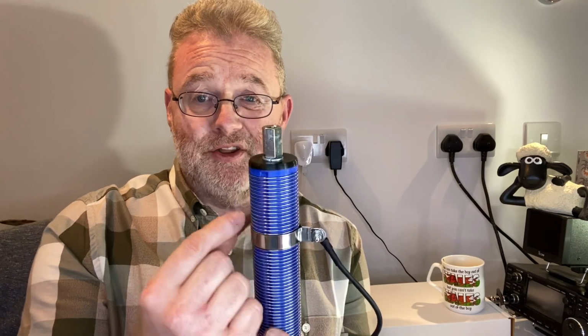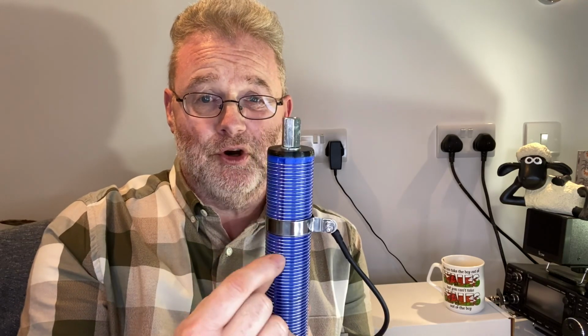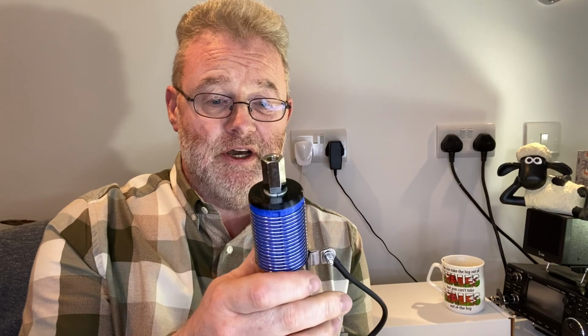The option would be that you would take a little analyzer with you, put it on the end of the coax and just move it up and down. Maybe listen for the background noise getting higher when you get to a better tune. And if you so wish, people mark the coil for certain bands. The only problem with that is if you permanently mark the coil for whatever band, in a different deployment it might be a different tune. But it gives you an idea of where things are, and I think you'll soon get used to it. It will be quicker than substituting one ham stick for another like I've been doing before.